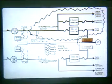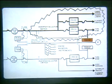AC power from the inverters goes through the phase breakers on the throttle lock relay box and is made available to the captain's flight instruments through the captain's inverter switch. The captain's turn and bank indicator and the gyro and flux gate compass are 26 volt AC instruments. The 115 volt AC is stepped down to 26 volts AC through two 26 volt AC flight instrument transformers. Two fuses upstream of each transformer and two fuses in the output section protect these items.